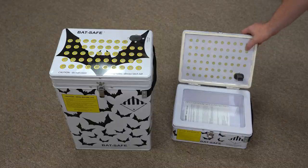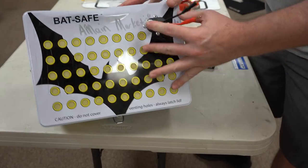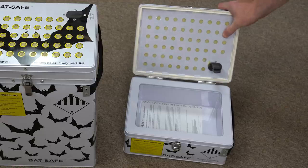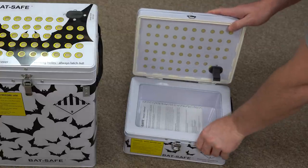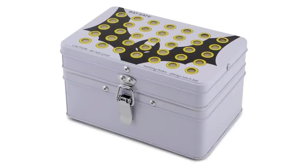The very best thing you can do when charging your lipo batteries is to use one of these Bat Safe charge boxes. Using it is super simple: put your battery inside the box, run your charge leads through the little rubber slot to plug into your battery, and on the outside of the box is your charger. Latch up the box and charge your battery. These boxes have vent holes on the very top lid to allow a compromised battery to ventilate, because during a fire there's a lot of pressure built up that needs to vent out for the box to stay securely shut. Some guys use ammo boxes, but if there is a fire inside an ammo box it's not ventilated and the box will get red hot. That's why the Bat Safe is the ultimate method to safely charge your lipos, and you can also store the lipos inside the box when done.